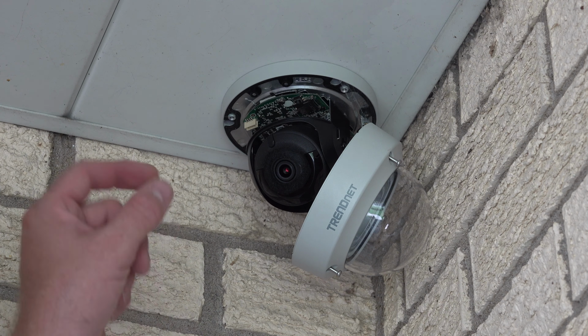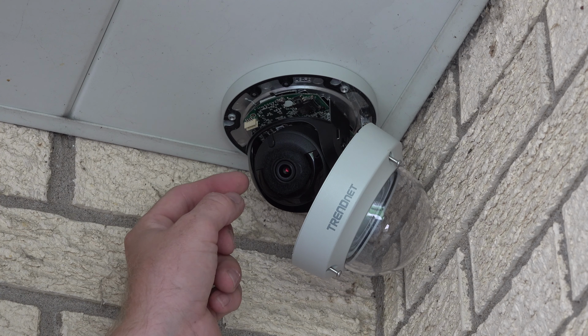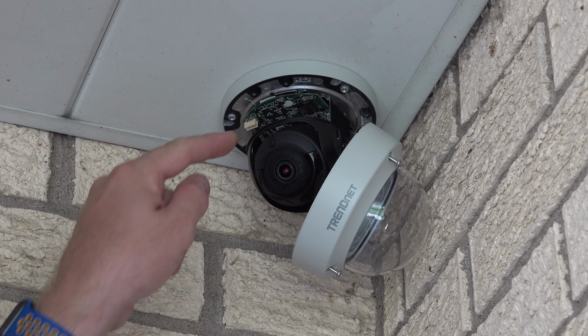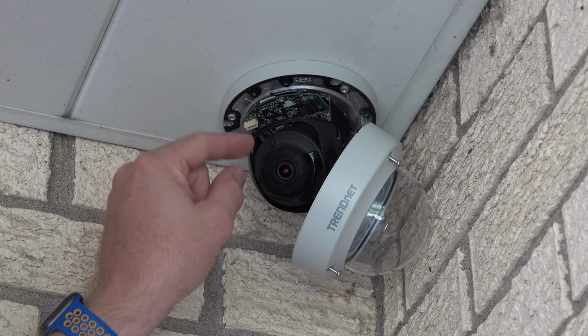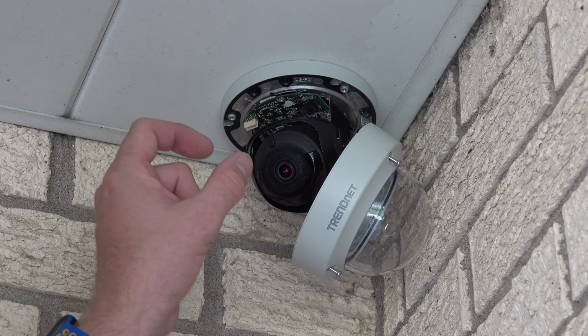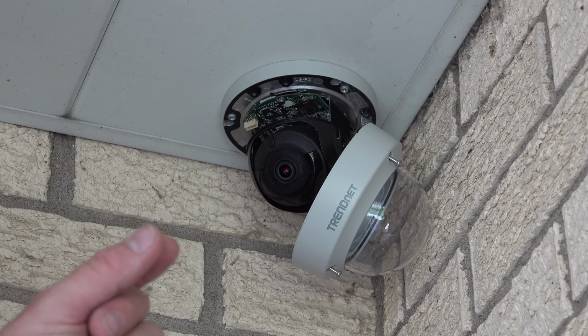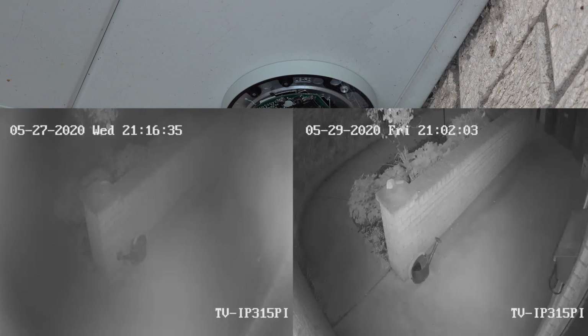it's actually some fiber for a big green egg, and it's adhesive on one side. It's just about 1/8 of an inch thick, maybe a little less. And I cut out a ring that went around the camera and stuck to it, but left the lens alone, but also left the IR lights alone. But it created a little bit thicker gap, kind of like if you had a little foam donut or something. And that's what I did, and it worked brilliantly.